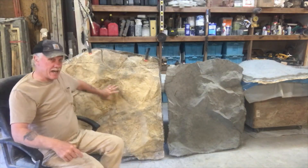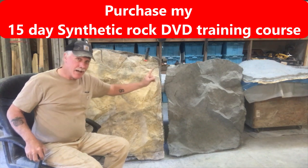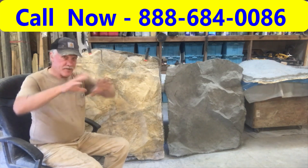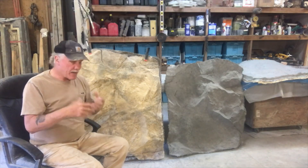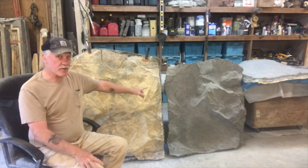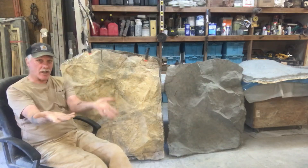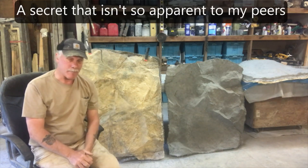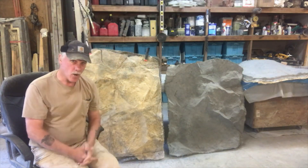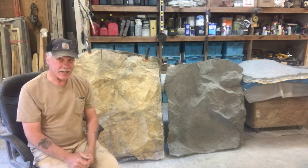My idea wasn't all wet. I took not only this mold but six others and made molds of them. I've got these panels right outside the shop but I'm not going to seal them and put release agent on them — I can't sell a panel that's been treated that way. Instead I come back to my original mold, make a mold of that mold, turn it over, make another mold, and I've doubled my library. That's a trade secret that isn't really a trade secret.